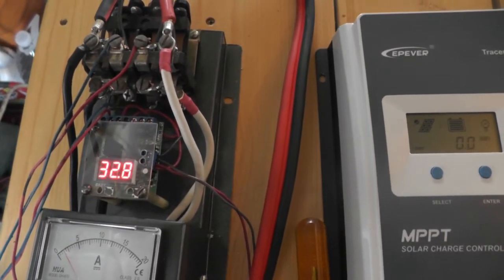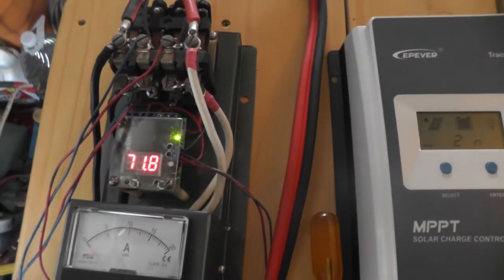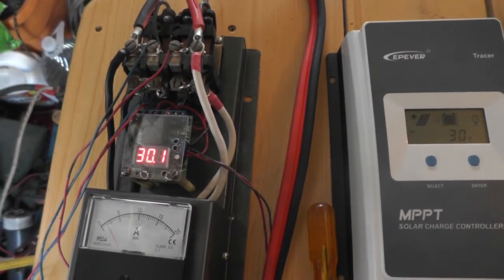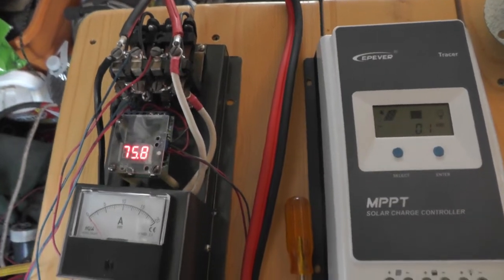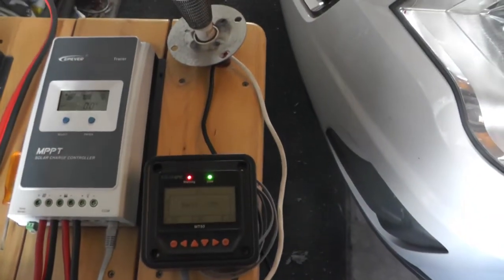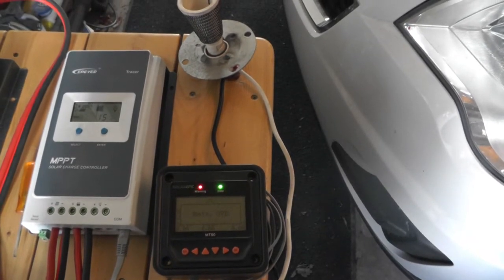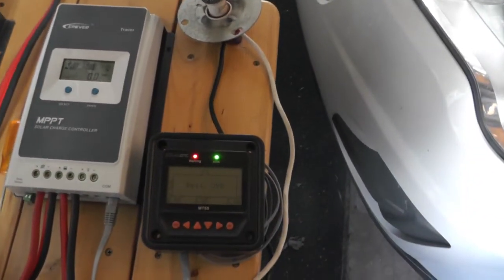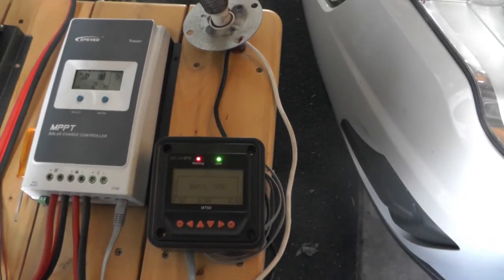It's not letting the input voltage go over 75. I've got it set so that 30 volts is when it kicks back on. We've got a battery over voltage, so let me turn the load on to get that back down. Until I turned the camera on, it never did that switching back and forth — it worked flawlessly.